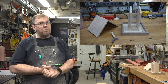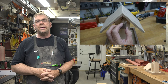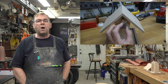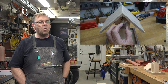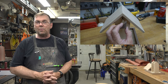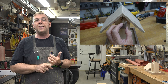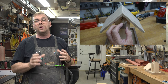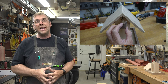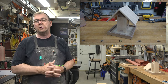The other key change is the plexiglass sides. My originals never had plexiglass — they were a solid cylinder with just a small window to show feed level, but it was impossible to clean them out and caused quite a few problems. So on today's build I modified the design to provide both a great visual for the feed level and a wonderful way to clean out the feeder, since water can get inside and gum up the feed at the bottom, preventing it from coming out into the tray for the birds.